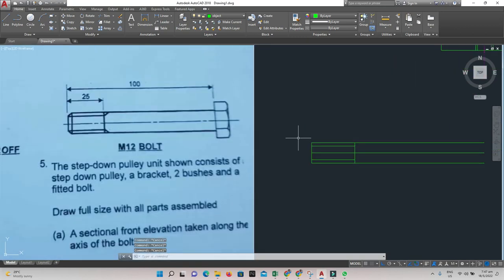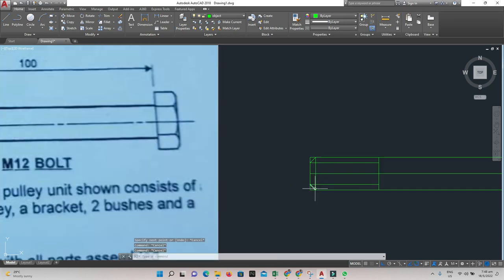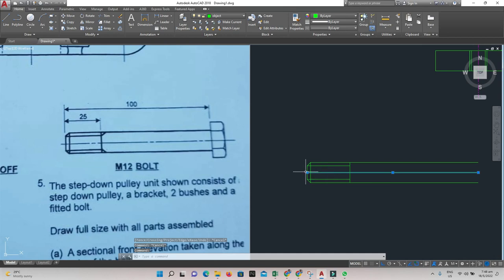At this point now, I'm going to offset 2 inward as well. So I'm offsetting 2 here, or you could use your chamfer tool. It's up to you. I'm just going to draw a line from, say, here to here, and do the same from here to here as well. Then I'm going to simply select these lines that I just drew for the chamfer, and then trim away here and trim away here. Now this line here, I'm going to extend it out a bit further like that.